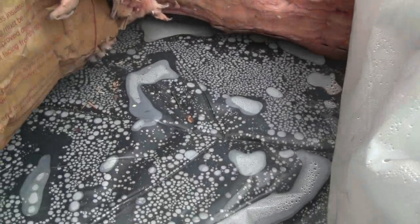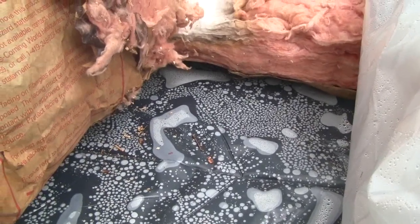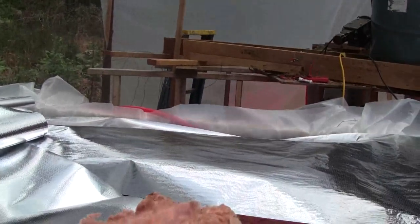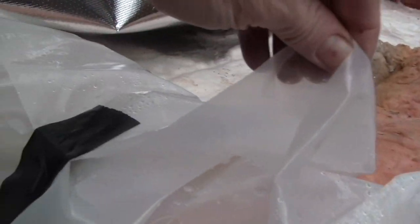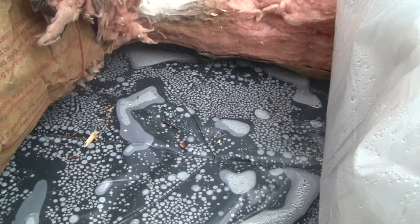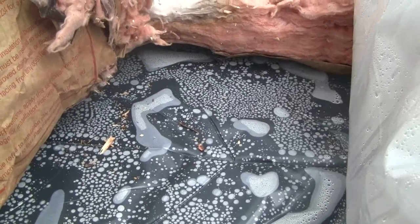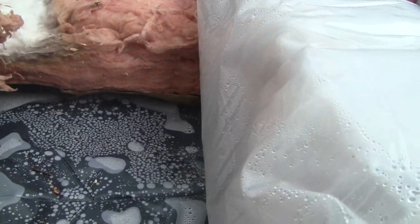What I did in here is put a large sheet of plastic that drapes all the way across the entire surface and comes up the edge. You can see it sticking up into the air over there on the far side, and here it is taped off to hold it. That puts a barrier that prevents water evaporation, which is energy loss, and it keeps the water in and keeps the insulation dry.